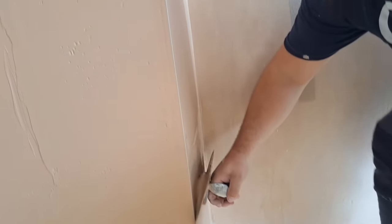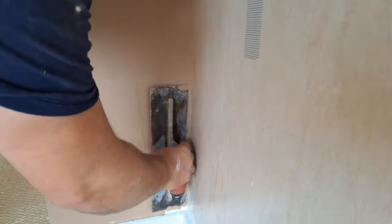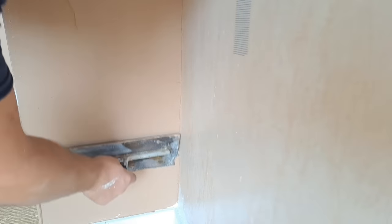All I'm thinking whilst plastering these walls is, wow, I can't believe how out of shape this is. Just even trying to fill these beads up is horrendous. So what it seems to me is, the last guy that plastered this wall, he's put his beads on proud and curled his wall out to the beads rather than getting the wall flat.